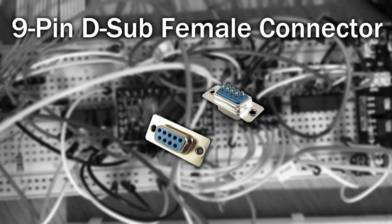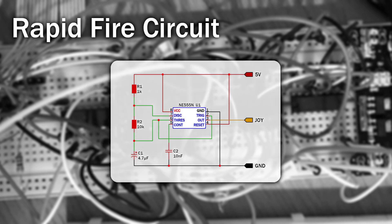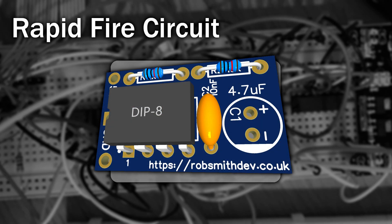Well in this video I'll attempt to find out. The first thing we need to do is understand the wiring. There are several platforms that include a 9-pin D connector and they share common pinouts. As I'm making this for the Amiga, that's the wiring I'll be using, but if you wanted to attempt this for another system then that wouldn't be difficult to modify. I also want to include rapid fire, as that's what the original zip stick and other joysticks of the era had. The rapid fire is just repeating pulses very quickly, measuring the zip stick approximately 15 times a second. From my electronics background I know the easiest way to do this is use the common 555 timer chip, and using this circuit diagram with these component values I should get a frequency of about 15 Hz.